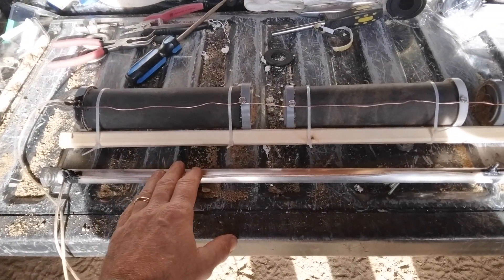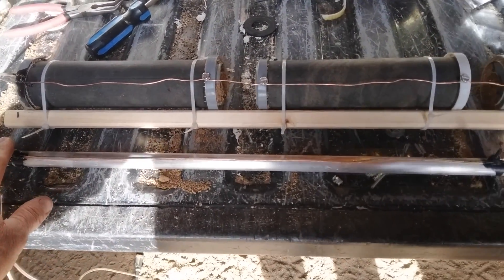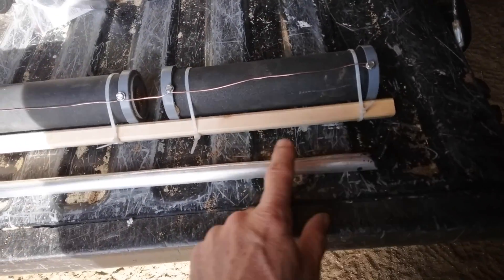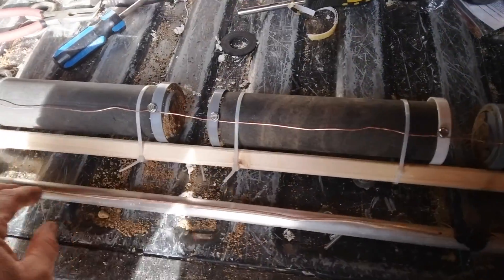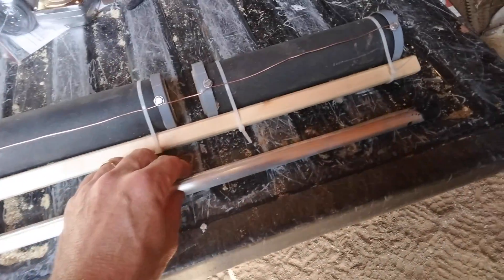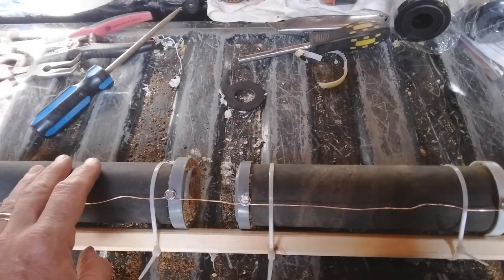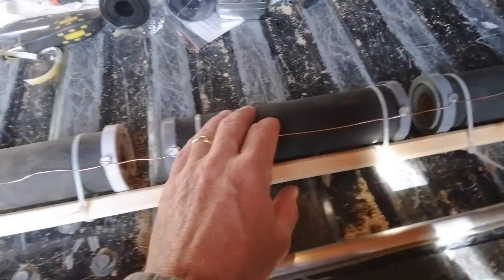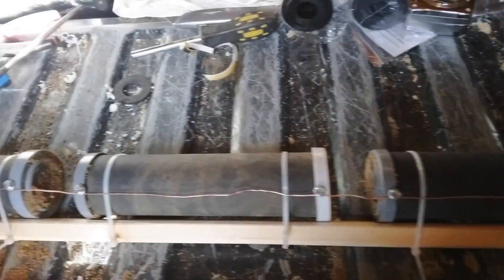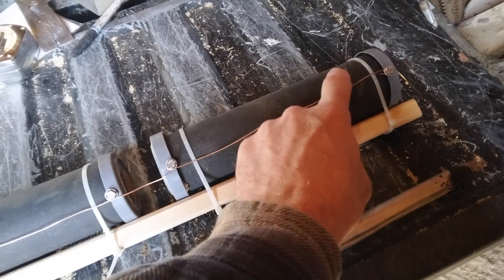I have the electrodes all set up and ready to go in the ground. This is the magnesium — this will be the negative electrode. I drilled a couple spots along this rod to have connection points, because in time this magnesium is going to corrode and deteriorate. This is the carbon electrode — this will be the positive. These are all the water filter cartridges, carbon blocks, and I've got a number of contact points along these just for a good connection, since they're a little bit weaker and could break off.